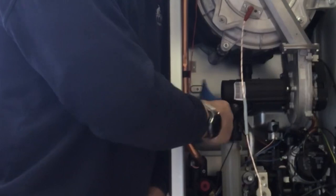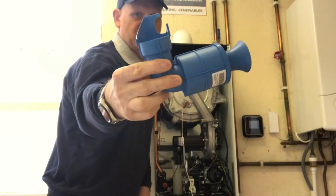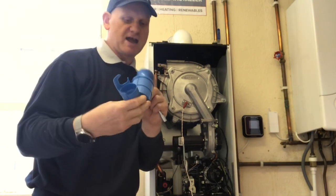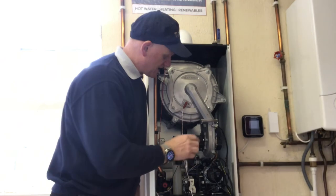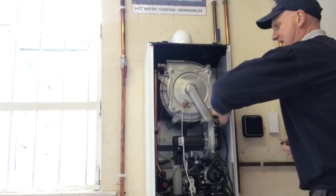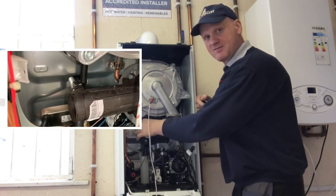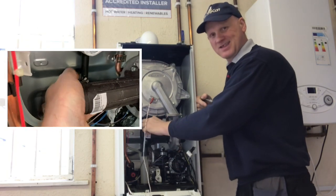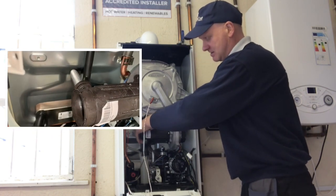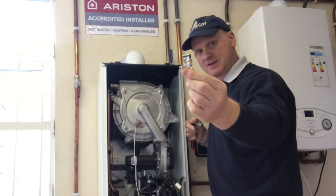This silencer just twists off and you can now see inside it. There is a sponge in there and you should check the sponge every service to make sure it hasn't deteriorated or broken. Now for electrical connections, we've basically got one plug on the fan. There's also a clip on this side to remove the gas coming in from the gas valve - just a straightforward plug. We've pulled the retaining clip off.